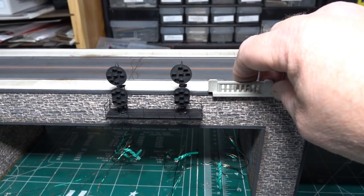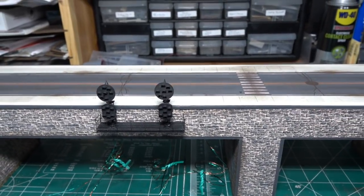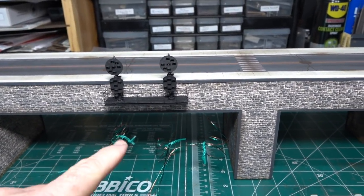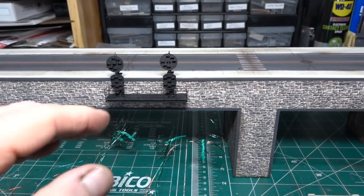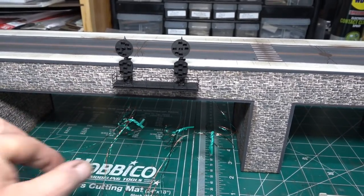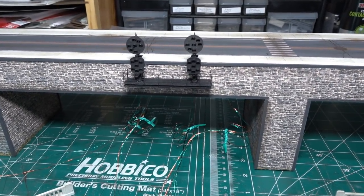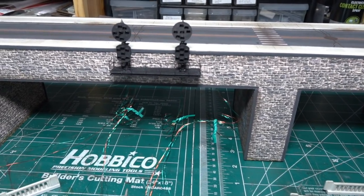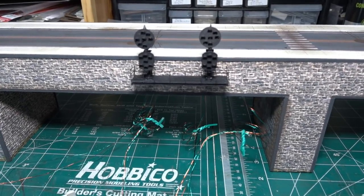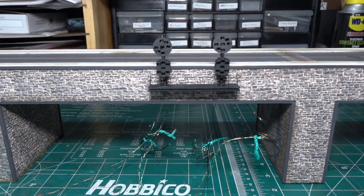So that's what I'm going to have to do, something like that. So I'm going to have to reevaluate how I cut these. I hope I have enough. Anyway, okay, but it's on. Now, I didn't really want to put it in just yet, but once I started drilling the holes and setting it in there and doing it four times, I'm like, it's going on. It's got to go on. I can't keep putting these wires in and out. I risk damaging them, nicking them, scraping insulation somewhere that I don't see. If that happens and wires are touching somewhere in there, you're hosed. You're never going to find it. You have to rip everything off and separate everything and get some nail polish or whatever. It'd be a nightmare. So, anywho, that's it. They're on. That's where they're staying.